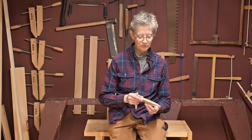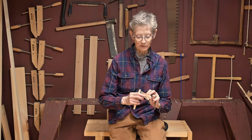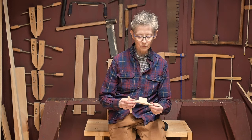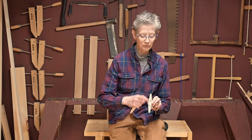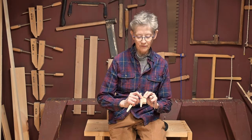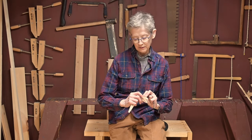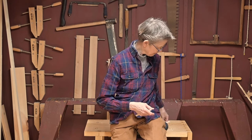Before we get started I want to describe the three cleats that I have here in my hands. This is the final one we made out of hop hornbeam. We're probably going to make a bunch more of these and we are going to clear coat this one. It's a beautiful wood, and just as a reminder, when you make these out of wood please make the grain go in this direction, otherwise it will snap. Use a fairly clear piece of wood — you don't really want too many knots in here for strength and ease of cutting.